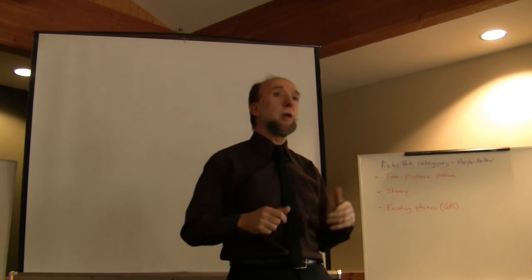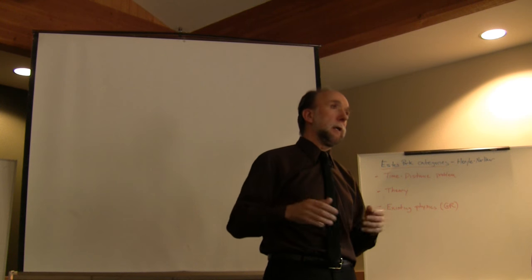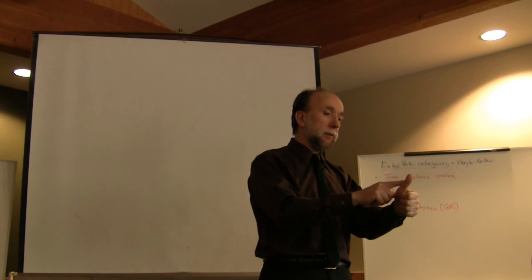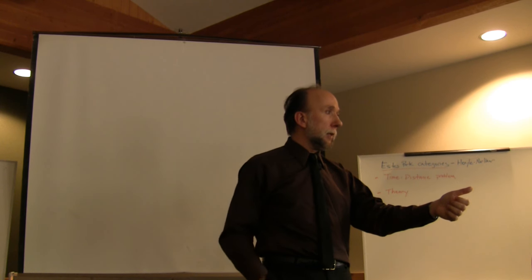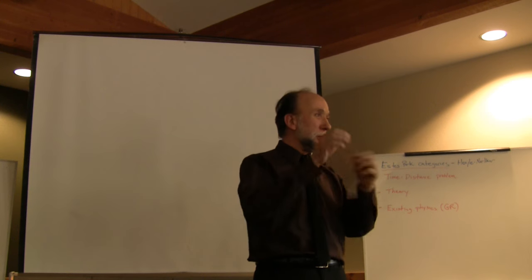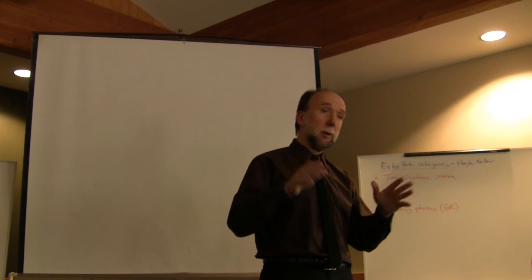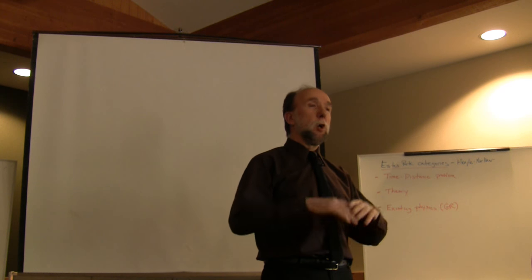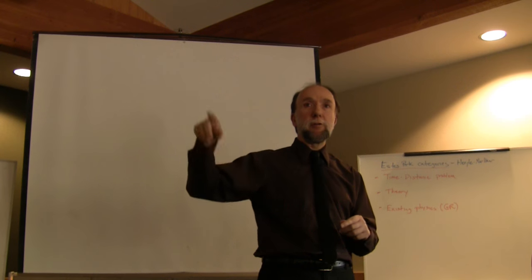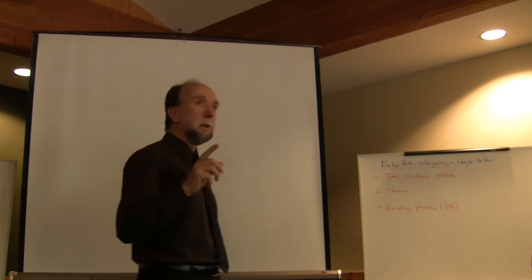Now probably you're going to ask me, how much smaller does it have to be? I would say at least by a factor of 2. And it's easily much lower than that. And I'm convinced we ran a stack that had a bracket made out of thin aluminum that was so thin, at my request, Heidegger was worried because he could bend it and so on. Let's run it. It made no difference in the impedance spectrum. No difference whatsoever. I can show you the graph. So that tells me that the bracket is not influencing at all the natural frequencies of the stack, even of a damaged stack, which is a more sensitive stack than one that is not damaged.